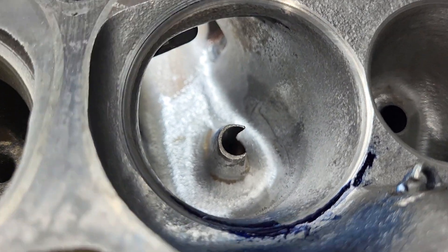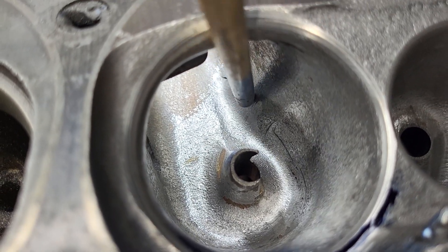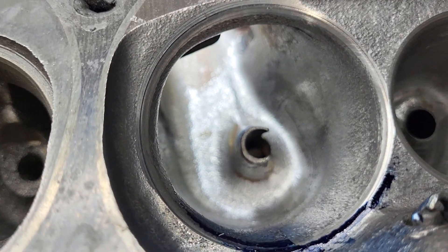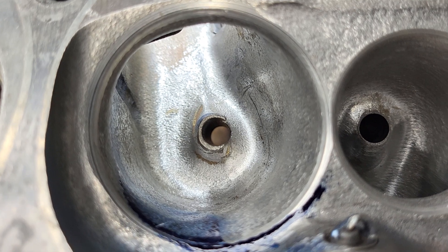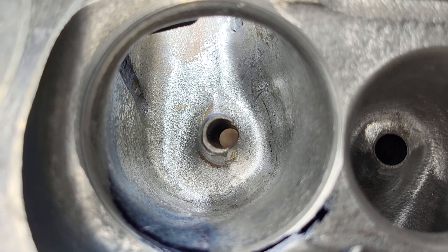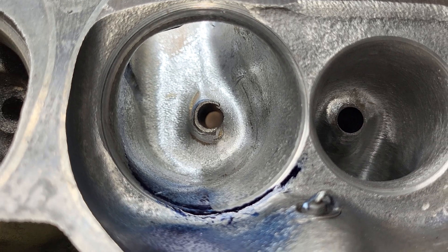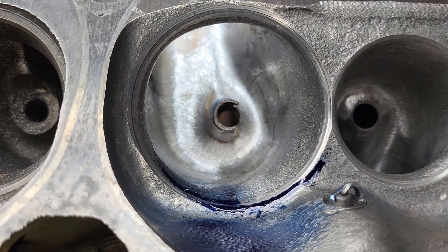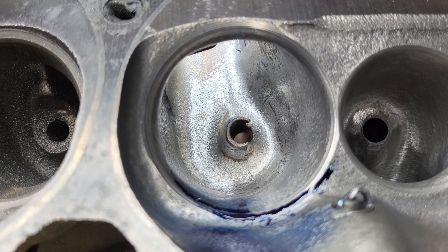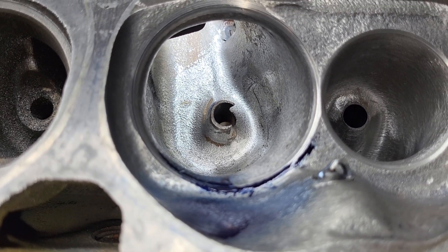I could do a little testing for thicknesses. In reality I could probably move this wall over another 50 thousandths before I have any trouble. This whole section I'm still having trouble even getting a reading — I don't know how thick it is, it might be quite thick still. To be honest, I'm completely sick of even looking at this head at this point. This is our 35th cut making it from a swirl port to a straight port.